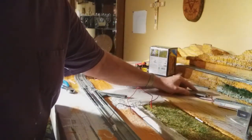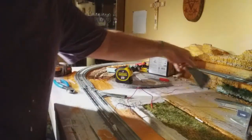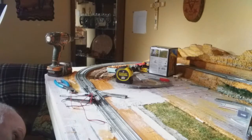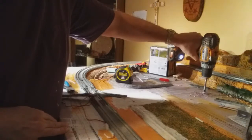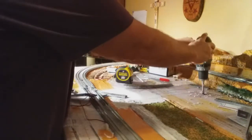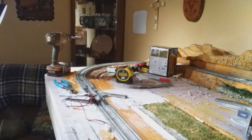I can now kind of put that back in place. Right behind where I made this mark, I'm going to drill that in there. I'm going to look to make sure I've got nothing intervening. I know I have a 1x4 support here, but I'm going to come on this side of this thing — that's where I'm going to put my hole. As you notice, I slowed down when I was drilling through there, because my fireplace mantle is right underneath there and I didn't want to hit that. I'm going to pause the video and vacuum all that up, and then we'll be putting that in.